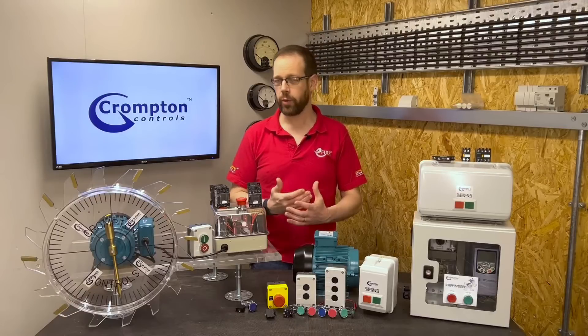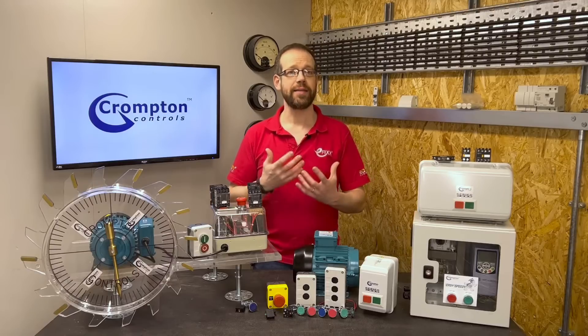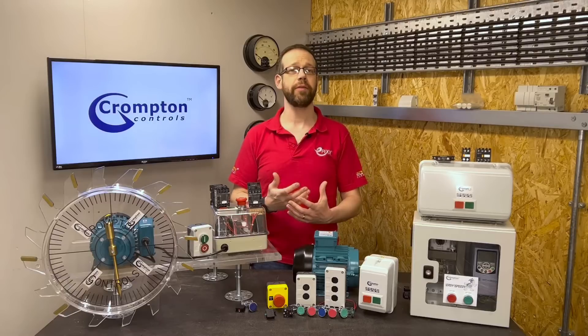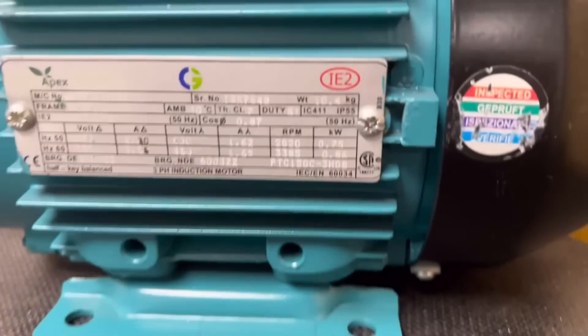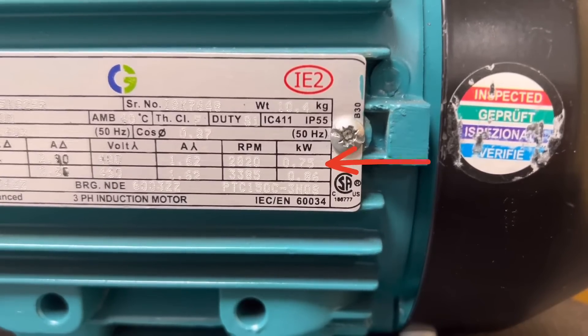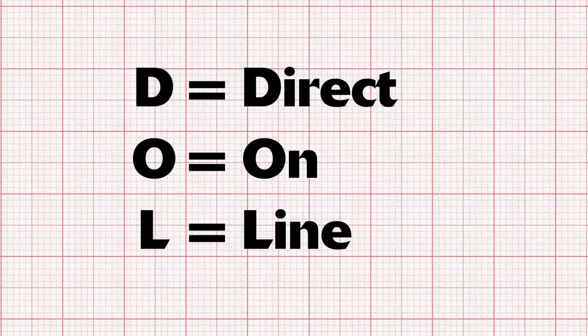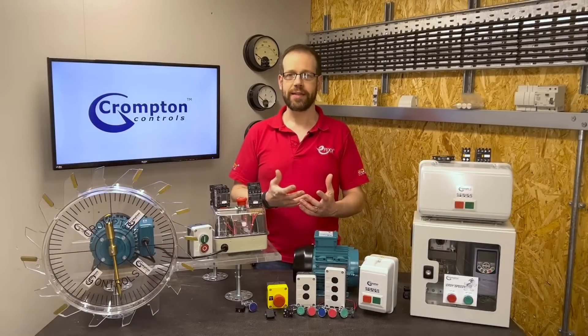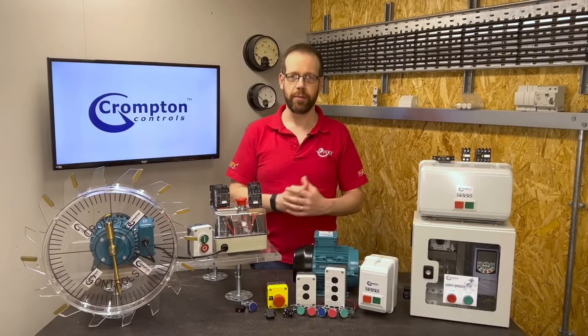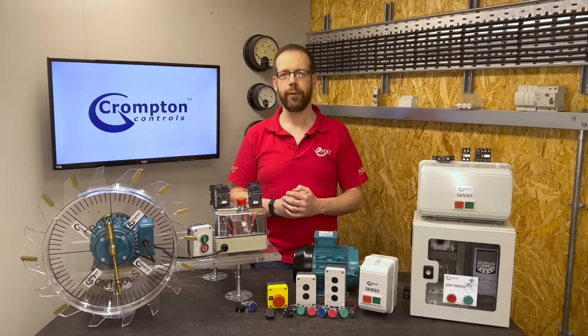So really there are two purposes to what we call motor starters. One is to provide control for turning the motor on and off, and the other is to limit this inrush current to a lower value until the impedance of the coils is in place and can oppose the current flow by itself. For motors that are about five kilowatts in power or less, the inrush current is sufficiently small that it won't cause any problems, and for these ratings we can use a DOL starter. DOL stands for Direct Online, which describes how the motor control connects the motor to the supply — it brings it online directly without any means of limiting the inrush current. Even so, you should check that the electrical installation has sufficient capacity to provide this inrush current, however briefly it may exist.